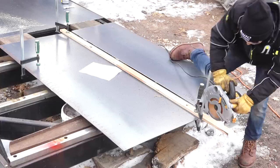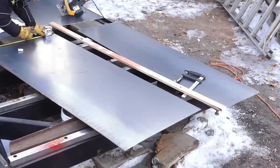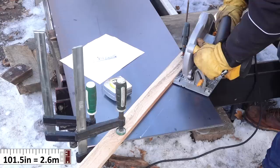of this sheet. I made myself a little cut layout guide template thing as well in the computer, which should help me better utilize the stock I have here and just kind of lay out the parts onto the sheets. The fenders are gonna be 10.5 inches deep, which will cover the wheels, and it'll put me at, I think, 101.5 inches wide, which is 1/2 inch narrower than the legal limit for width.